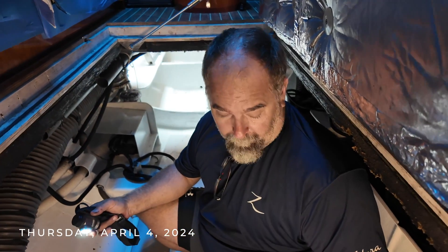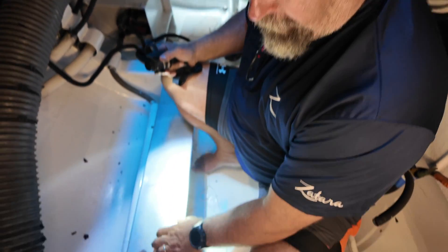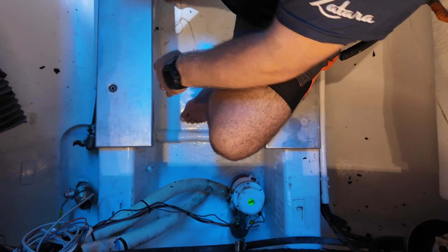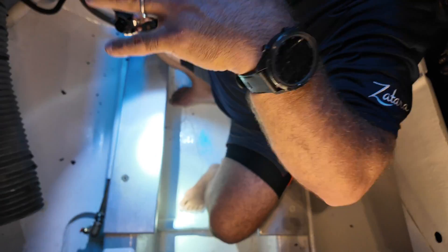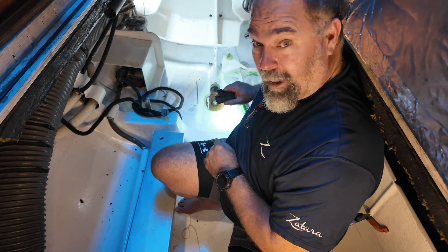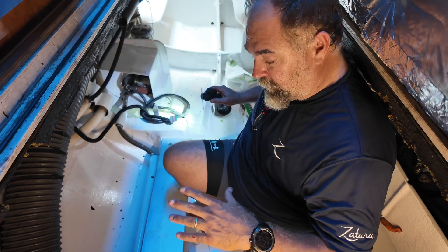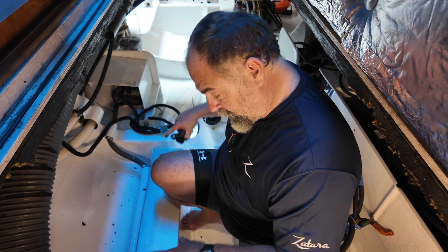So what we've done here is we've got everything prepped for the new engines. We've had to make new mounting plates for the engine mounts right here. These stringers were a little narrow, so they had to widen out the mounting plate for the new Yanmar engines. Just Catamarans had these built and they bolted down. When they bring the engines down, they're going to set the engines on these, line up the engines with the drive shaft and prop shaft, get the alignment and angle right. Once they've got that right, they'll test that several times, then they'll drill the holes and mount the engine.